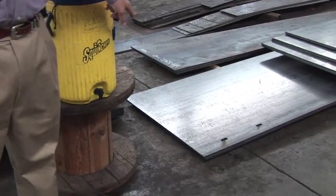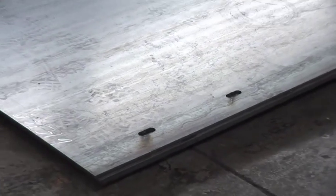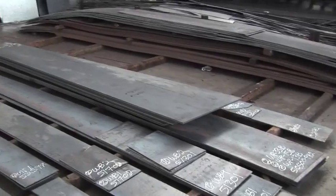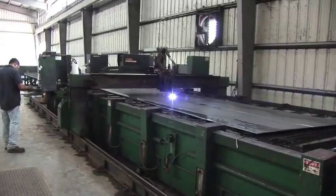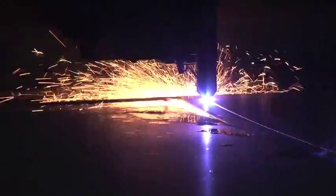You'll see the slide holes for the cable braces in both of those sets of webs, and you can turn around and look at some of the webs back here that have holes burned in them, and all of these holes get burnt using the plasma burner. That's the reason why only certain items get cut in the shear and certain items get run in the plasma. Those parts right there get downloaded directly from our engineering software, so no one touches them.